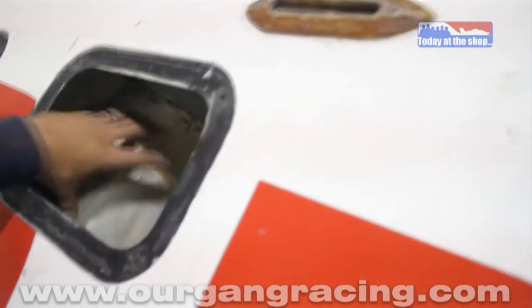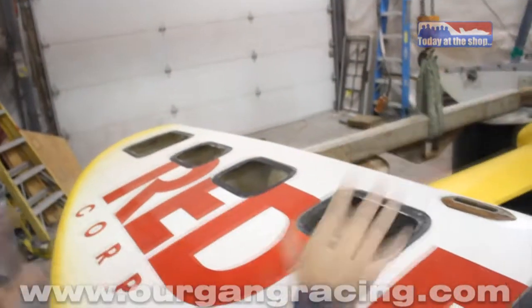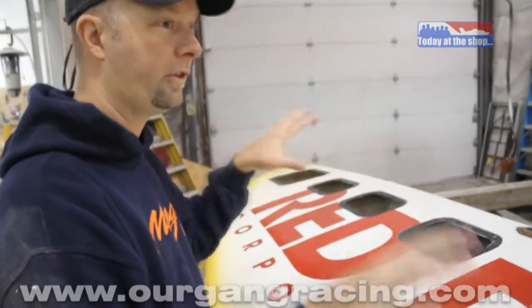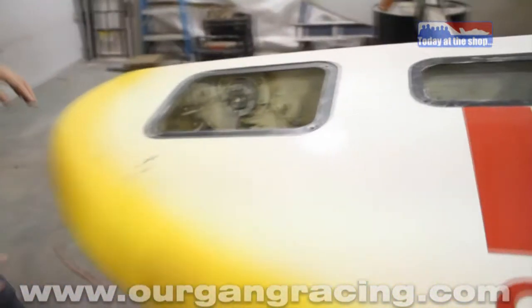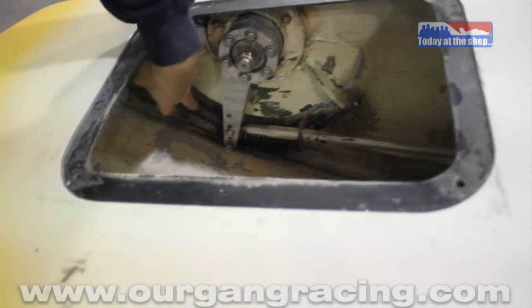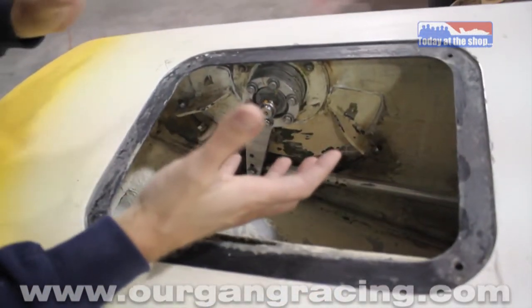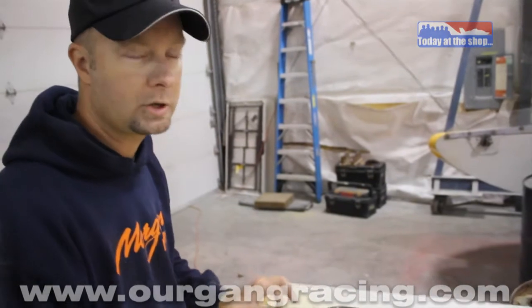Moving further forward, something we didn't look at over on the other side is you can actually see the box spar. There's a box spar back here and then there's the front spar here. A spar is a piece of material that runs all the way across the boat and ties both sides together — it takes the flex and makes the boat move as a complete piece rather than independently with the sponsons walking back and forth. You can see with better lighting here we've got a spring on either side of the wing hardware, which allows you to put spring tension to keep the wing at neutral. When you press one pedal you put trailing edge down; when you press another pedal you put trailing edge up. It controls the attitude of the boat.